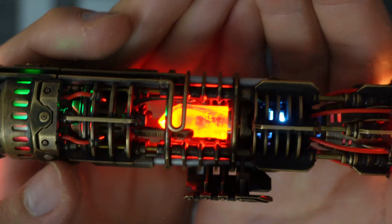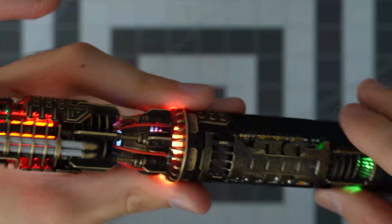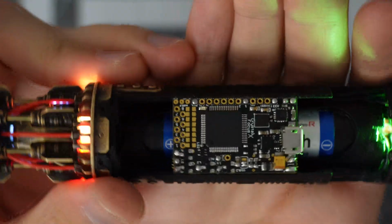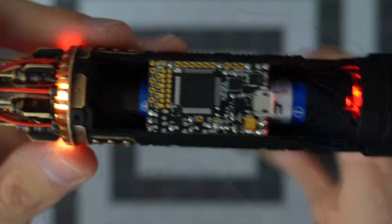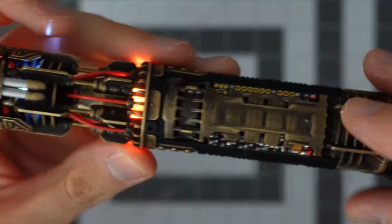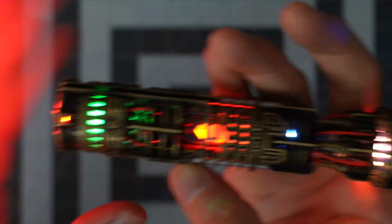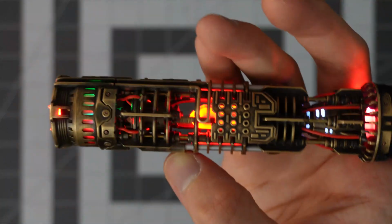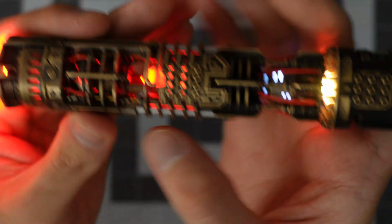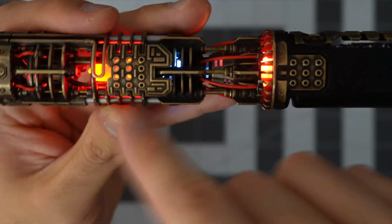Monitoring energy flux. So the motor is actually wired up to the 4th color channel. So there's 4 of them: 1, 2, 3, and then 4 over there. This is important to know because if you want to adjust the spin speed of this motor, you have to adjust color channel 4 in the color file in the config, on the SD card. You adjust the 4th color channel, and that's what adjusts the speed.